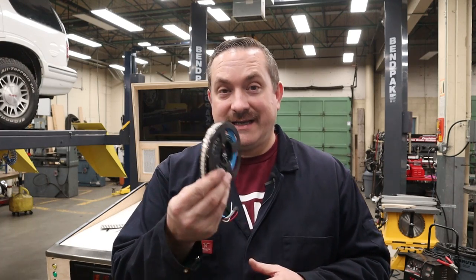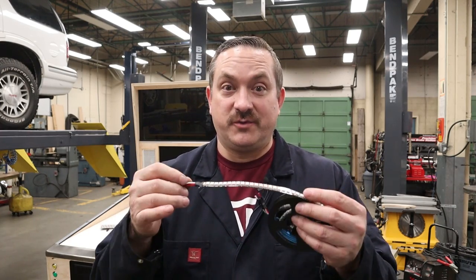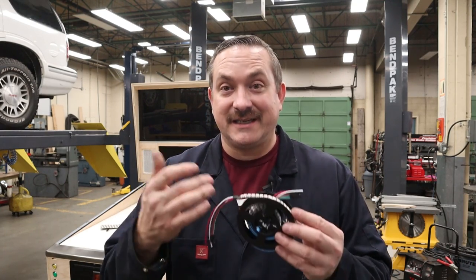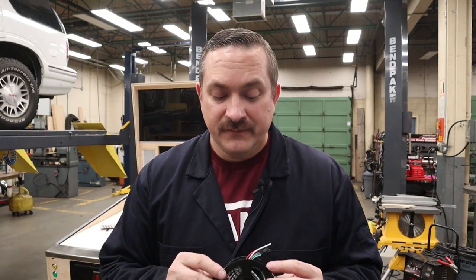To test these, it's not like a regular bulb where you just get a ground and 5 volts and it lights up. It doesn't work like that. We have to have some kind of microcontroller that can send a signal to all of these LED strips. The way to test this is we're going to get our Teensy and our octoboard — we're going to have to put those together for the pinball cabinet anyway. So let me show you how we're going to solder those together.